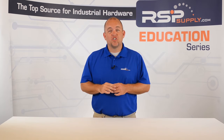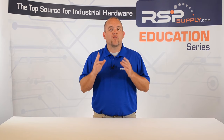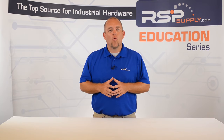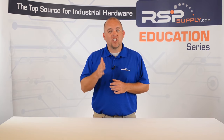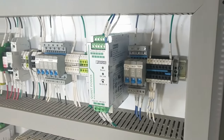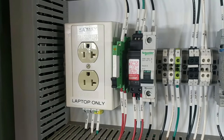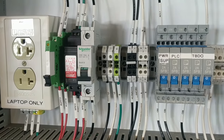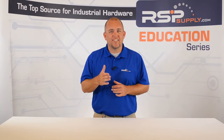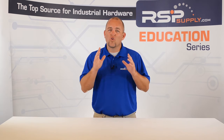Number three: check power one breaker or fuse at a time. When you first begin to test your panel and its functionality, one of the first items that have to be checked is the panel's power. You need to make sure that it turns on and ensure that power is being properly distributed to all of the components throughout the panel. It is critical that before the panel is energized, all of the breakers and/or fuses are off or disconnected.